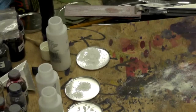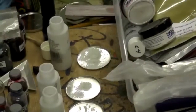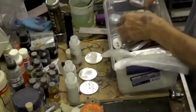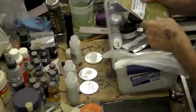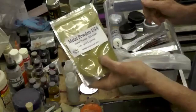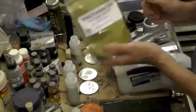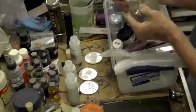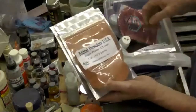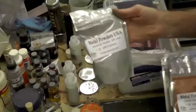The important thing with stones is to pick a soft stone. I once tried to inlay quartz — that's a huge mistake. You can't clean it up or sand it. Metal powders — I tried brass powder and didn't like it, it's sort of a brownish yucky color. Nickel silver should work well, and copper looks good. Aluminum should probably work better than silver itself.